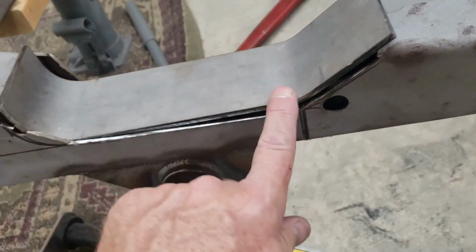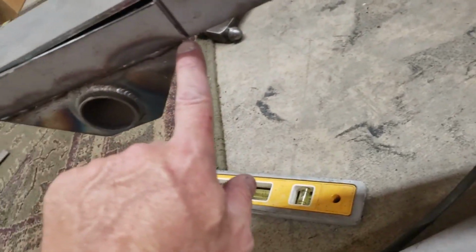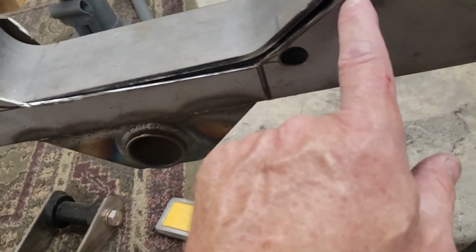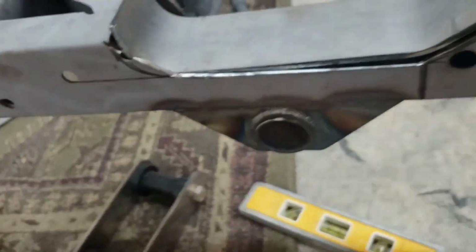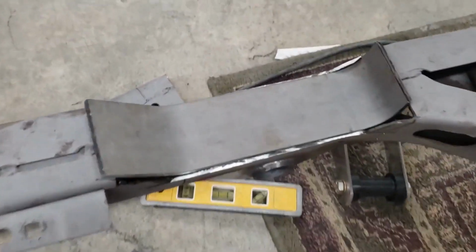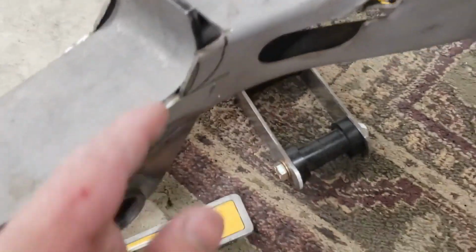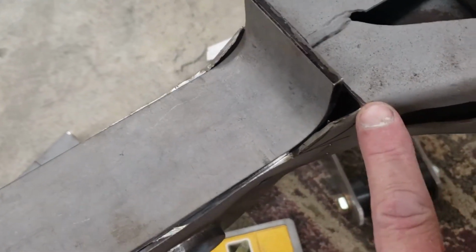And we want this corner to be 1/4 inch ahead of where that tab sits, it says. So looks like I might have to trim a little more forward, and then there'll probably be a little excess on the top of each side that I have to trim off, even once I get it where I want it. And then over here on the inside, this notch goes right where this little frame intersection is. It won't quite fill this little spot right here.